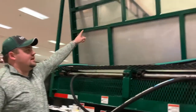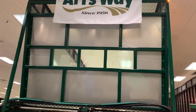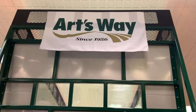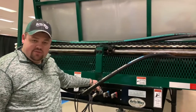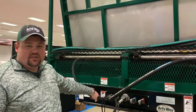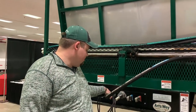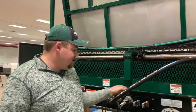On the front of the box we have a 3/8-inch thick Lexan window — the largest and widest window on the market. From the top you can see the outside of our 14-inch side extensions. All connections here are very simple: we have one electrical connection for your standard 8-pin, and we pull live power for our work lights and all hydraulic features off this single connection, so there is no need for an additional electrical connection to run your logic sequences. We also have standard hydraulic 1-inch lines running the full length to the back of the box for supply, as well as our gladhands.